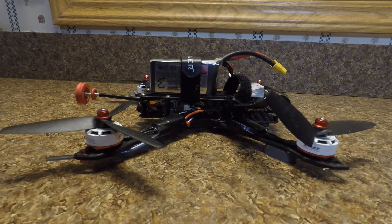Jumpering them also allowed the OSD to ghost in the background. Doing it that way I had perfect video with no cutting out, and I could still tune using the OSD — I just had to make sure the camera was pointing at something gray to see the OSD ghosting. After having two Betaflight boards with the exact same problem, the only thing I can think of is that I hack up these boards too much. I had a hell of a time getting that VBAT jumper soldered, something messed up, and maybe too much heat caused another bad solder joint.